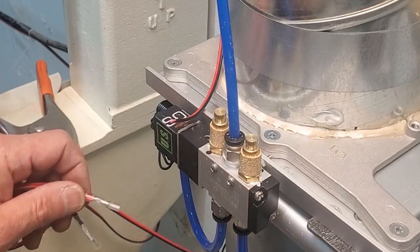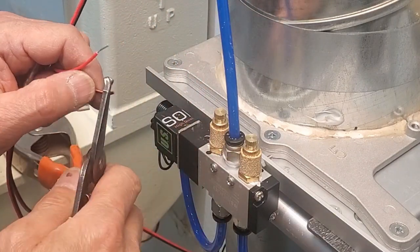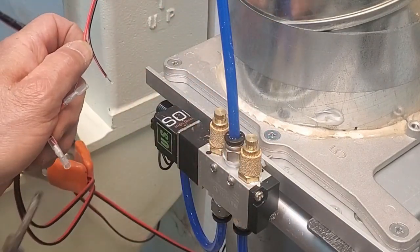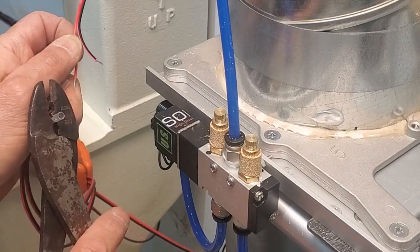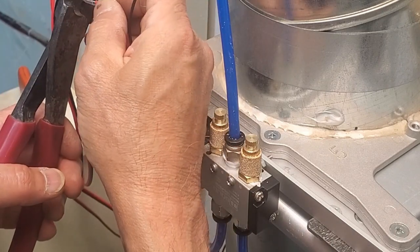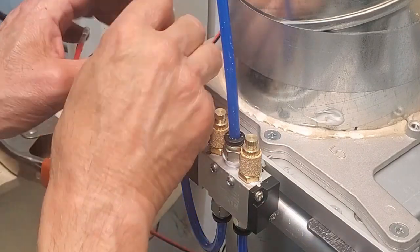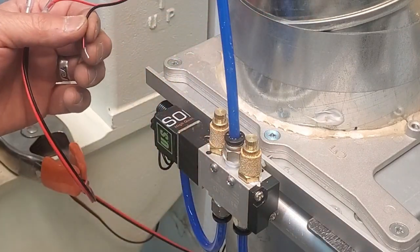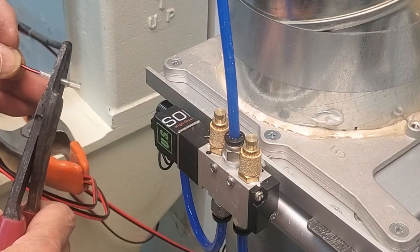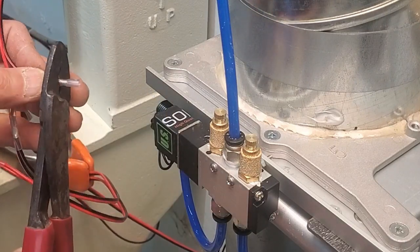A lot of systems are set up to automatically turn on a dust collector — why didn't I do that? That was a system-based decision. I have a 10-horsepower central collector serving a dozen machines with the potential of multiple workstations in use at any given time. It sucks a lot of amps and takes several seconds to get that 10-horse motor going, so I don't really want it turning off and on every couple of minutes. I do have a few remote control switches placed around my machining areas.